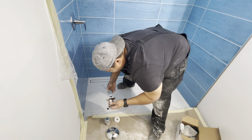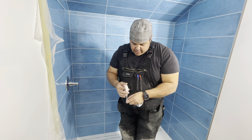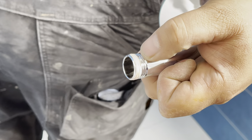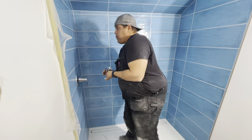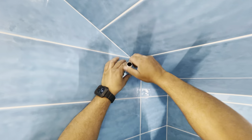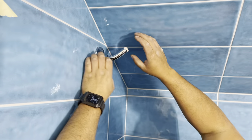Just as a little extra protection to confirm that the joint's not going to leak, I'll wrap my tape just like this and just do one wrap, just around from the front. That just helps to lube the threads, and also if there is going to be water that's going to escape through that gasket, I'm hoping that this will seal it. So just slide this in here and then spin this arm in just like this. This doesn't need to be crazy tight, but you can feel it's starting to get tight there.